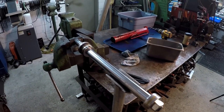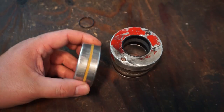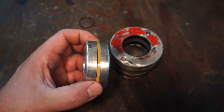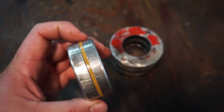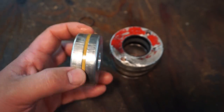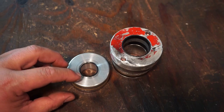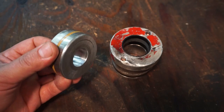There are your main sealing components: the rod gland and the piston. As far as the piston goes, that is a PTFE seal with a rubber expander underneath - it's like a square o-ring that helps expand it out and push against the cylinder wall. It's not in bad shape, but anytime you go through a hydraulic cylinder you always replace all the soft parts. You also have a very small zero-series o-ring on the inside of the piston that seals against the threads and keeps oil from bypassing through the center of the piston.